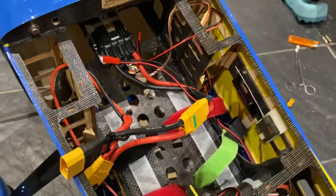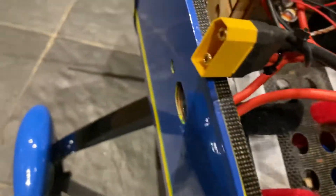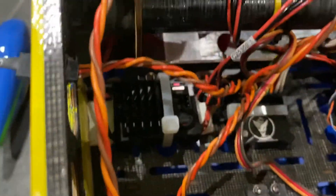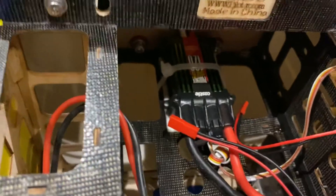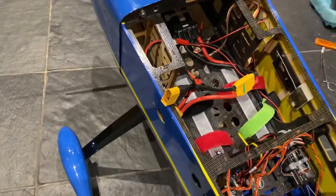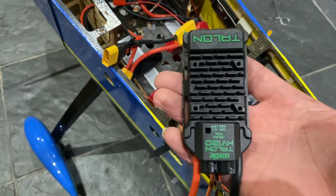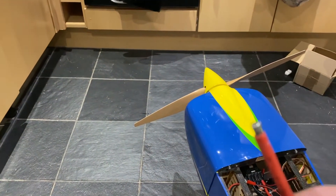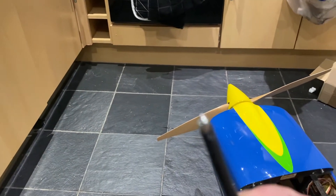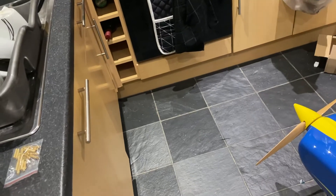This is what I took out of another airplane, and the one that's mounted is here. You can see where my finger is — where that white tie wrap is — that's the BEC that goes with this ESC. And this new ESC here has already got the BEC built in, so all I need to do is solder the red wire and the black wire, and that should do the job.